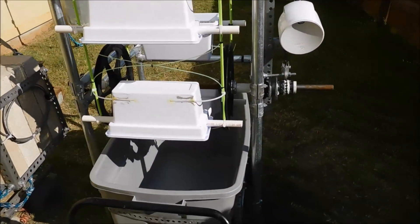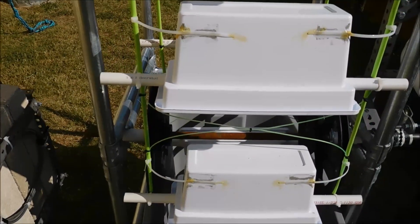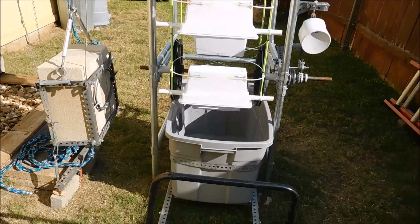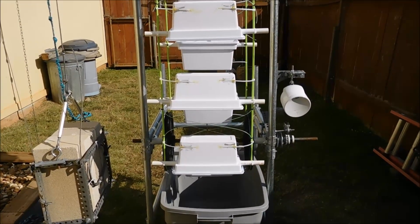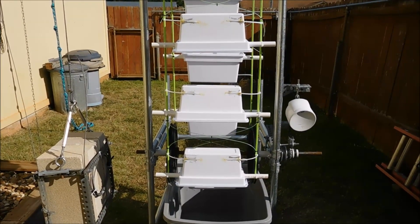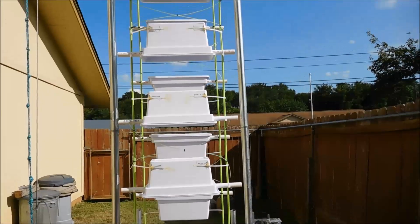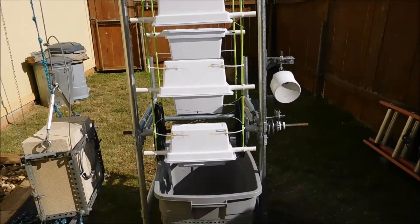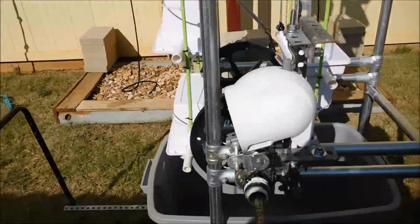You can see that the water is dumped here into my container. And once it's filled up, you have to lower your carriage and transfer this water back into the carriage containers. You can do that as I've described on my website by making this particular collection point higher than the point where the carriage rests and let it flow back into the carriage. Of course, you lose a certain portion of your drop time, but it'll be ready to use again more quickly. Or if you have a solar panel and a pump, you can lower your carriage and drop your pump into this container and pump it back.